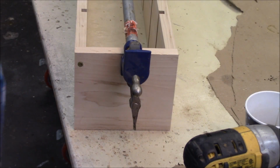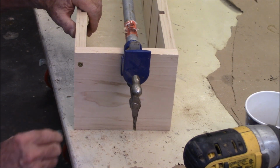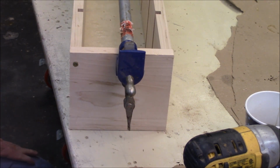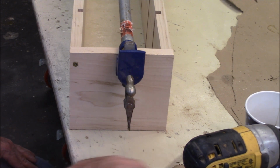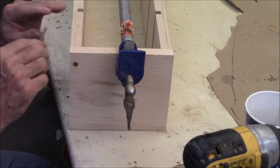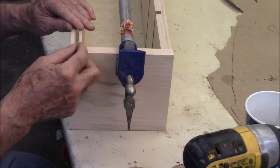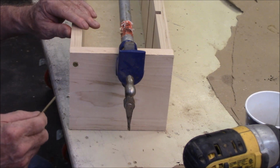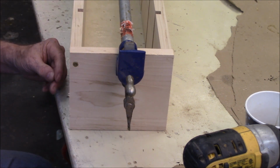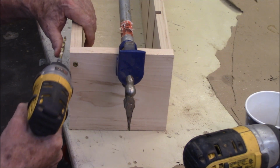Putting the ends on. The ends are 6 inches tall here and 7 inches wide. And I like to go by the advice, don't make a mistake on purpose, but that's exactly what I'm doing here, because I'm using 3-inch screws here, which means that my screws are going into this 3/4 inch maple 2 1/4 inches. You know, I need 1 3/4 screws, or something much shorter than that, but this is all I got. And so I'm having to take extreme measures to keep from messing it up. First thing I'm doing is drilling way into the wood.